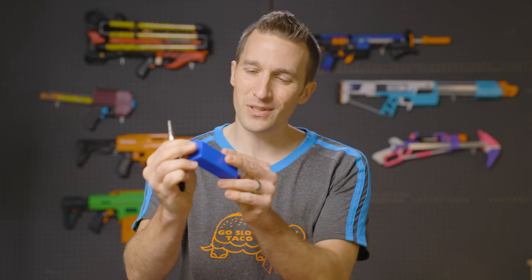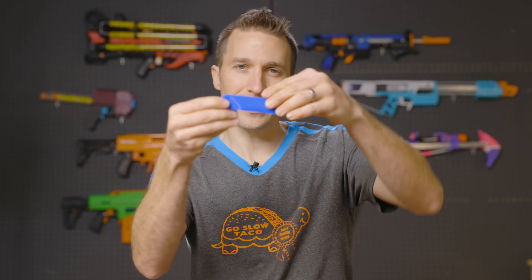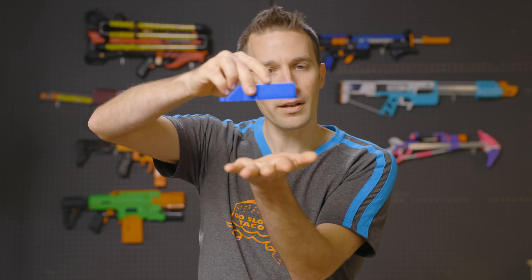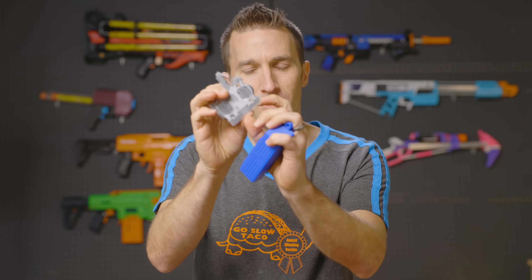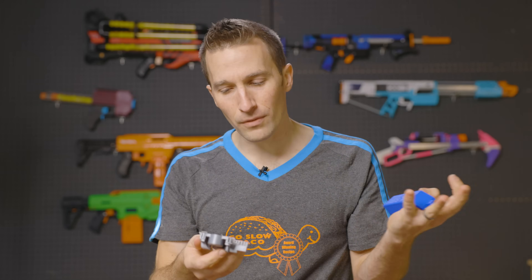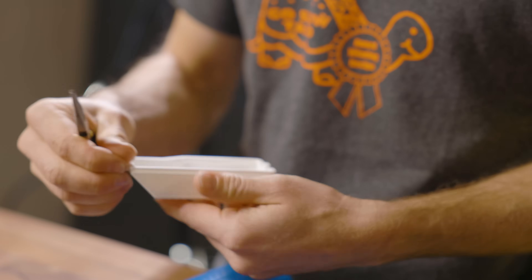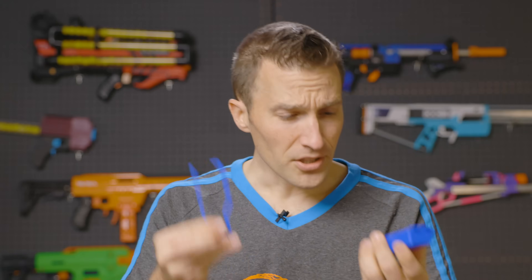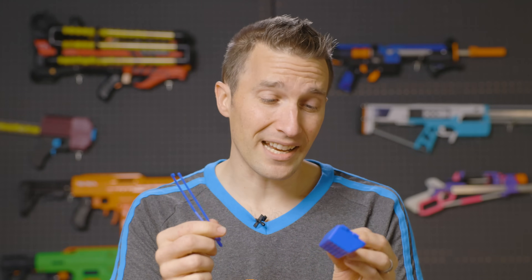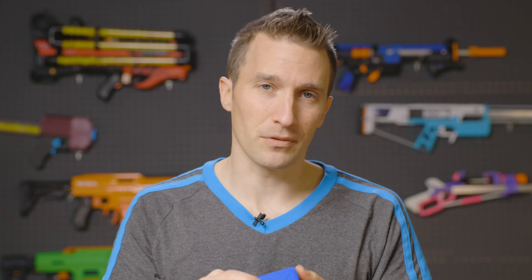This is a battery door for a Strife, designed by Tarek. It has a feature where there is a recessed nub on the back that needs to slot in — essentially, it would print on air. General automated supports are very messy; they end up all over the warehouse and take a lot of time to clean up. But what we've trended towards is custom supports for as many parts as possible. In this case, you can break off one clean part and you are done. Doing supports like this generally saves plastic and a ton of time.